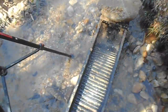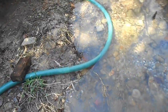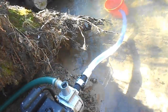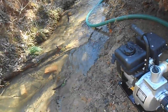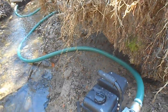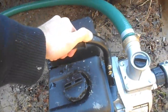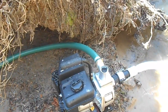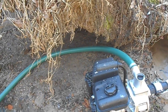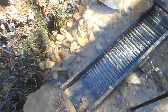I've come down here to the creek to test my pump. I got an inch-and-a-half pump from Home Depot — it's supposed to be 90 gallons per minute — but in actuality this thing's barely putting out 30. Since it's only putting out 30 gallons a minute, that's not working so well as a dredge, so I've had to modify my design somewhat. Instead I just got the hose going to my sluice box and I'm just shoveling in like a high banker.